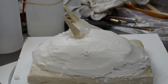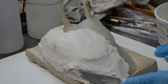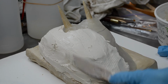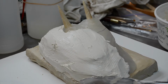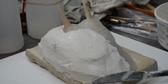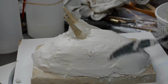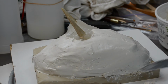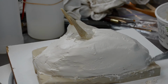That's coming along nice. That's nice and thick right there. That's a good thickness, especially on the sides. You really want it thick on the sides. You want to give this silicone a lot of support on the outside here. Now I'll take the flat end of this and use it to draw along and make sure the bottom line of my plaster jacket is nice and neat. Right? Keep bringing it up and up like so. Voila, there we are.